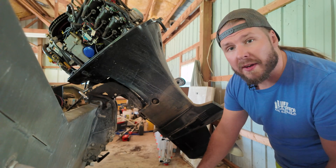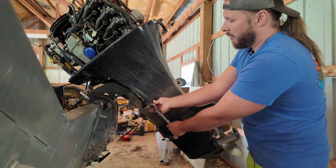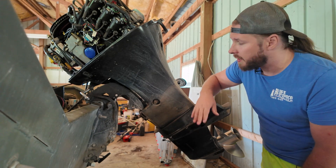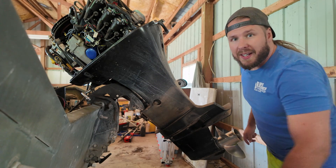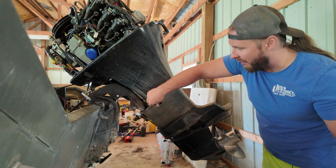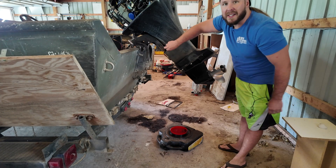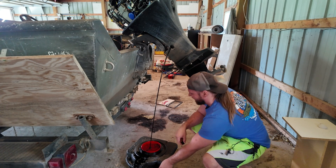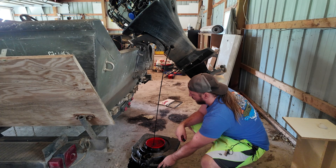You're going to put your oil catch can or whatever you're going to be using below you and you're just going to go ahead and loosen this oil drain plug. Now oftentimes they would say you need to bring your motor up to operating temperature first. I bought this boat at auction and I don't even know if there's oil in it, so we're going to hope that there is. Once you've got that loosened you can go ahead and unscrew your oil drain plug. You want to do it slowly and make sure you hold on to it so you don't have to chase it around your garage. And then you try to get the oil into the can — oh hell no, not even close! I didn't know it would have that much force. That's okay though — nothing a little kitty litter won't fix.